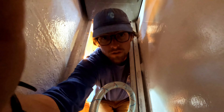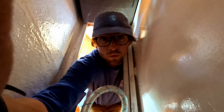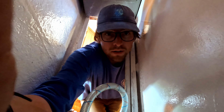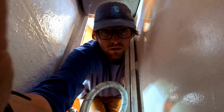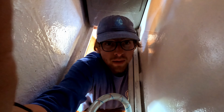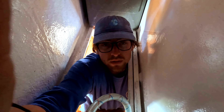This is where I have both of our foot pumps — one for salt water and one for the new water filter — so we have clean drinking water without running a pump. I'm going to tee into the water right after it comes out of our manifold from the port and starboard tanks. It goes through a 20 micron filter right off the bat, then straight into this pump. From the pump it goes into the Acuva carbon filter, then into the UV filter, and finally up to the smart faucet. Everything is connected with PEX, so hopefully I won't have to touch any of this stuff again once it's in.